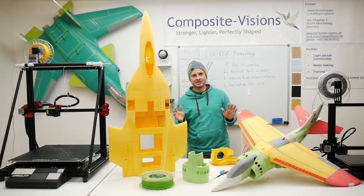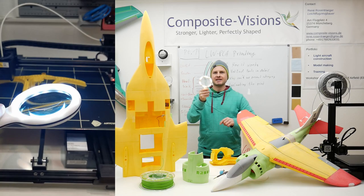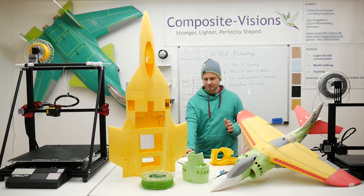Print small parts, start with a low temperature, look at the result closely. I also recommend using a loupe with included lights — with different colors of light. This helps while observing prints of different colors. Take a closer look at your print result and see if you have a homogeneous structure.